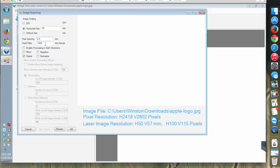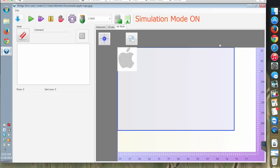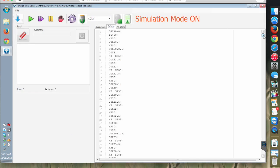You can generate a preview of the grayscale image to be engraved, and I highly recommend you only do this on a computer that has more than 1 GB of RAM. My netbook was having a real struggle fest with this part. Once you've got your settings plugged in, the software will generate the G-code and handle sending it to the Shapeoko. When you learn the GUI and naming conventions of ObjectWorks, it becomes a fairly fast and simple process.